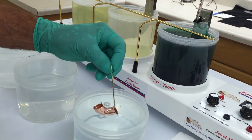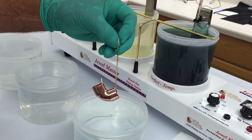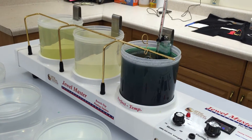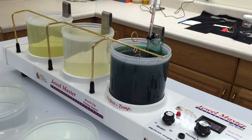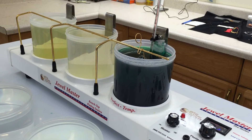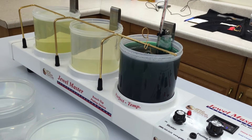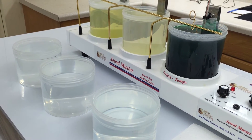As with gold, I'm going to go into my plating solution rinse water first, just so I don't drag any contaminated water back into my plating bath. Now we're going to put it onto the bus. We're running about four volts and about 2.8 to 2.9 amperes of current. For the sake of the video length, I'm going to plate for one minute on this side, then take the part out and rotate it and plate for one minute on the other side, so that both halves have equal exposure to the anode.